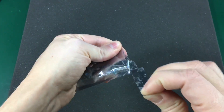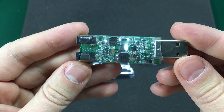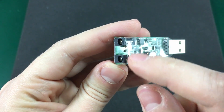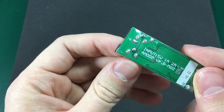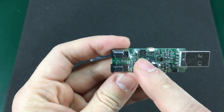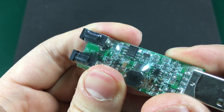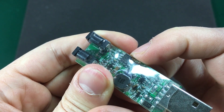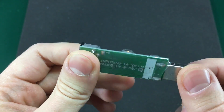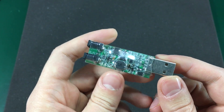Our next item is a 2S lithium battery charging module. It's actually one of the few 2S charging modules you can find on eBay. I'm not sure what the original intended purpose is. It has these two smaller DC jacks which by the looks of it are connected in parallel, so it must have been intended to charge something very specific that uses a 2S lithium battery pack. It has a 5V USB input, so it must have a DC-to-DC boost converter to reach the 8.4V needed for charging a 2S pack. And I'm curious to see what chip they're using to do the charging — and wow, it's an LM358 dual op-amp. It's basically a jellybean op-amp which is probably used as a comparator in this circuit. I was expecting a dedicated 2S charging IC. So I guess they're using a boost to raise the voltage up to 8.4V and limit the current to 0.5A, which is the charging current.